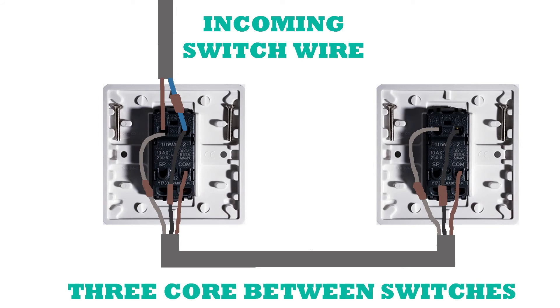Now we need to connect to the second two-way switch using a bit of three-core cable. The colors are gray, black, and brown. It doesn't matter which you use as the common wire, so long as it's the same at both ends. I always use brown as my common so I always remember which is which. The gray and black connect into terminals one and two on both ends, and the brown similarly into the common terminal at both ends. Put a little bit of brown tape or sleeving on all the non-brown cables to show they are in fact live wires in the switching circuit.